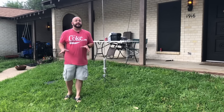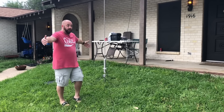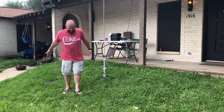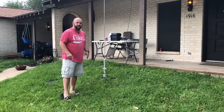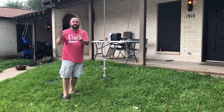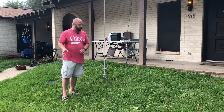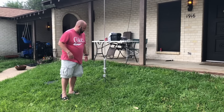While this is extremely narrow-banded, it just goes to prove we can do this. My radial field is only four meters wide — about 13 feet radius. This is just my garden. Before, I would have had radials running into the middle of the street; now they all fit here. If you're on a beach or a highly populated area, there's less chance of people walking into your radial field. Now I'll put the Silver Bullet Mini on and check 40 and 20 and a couple other bands.